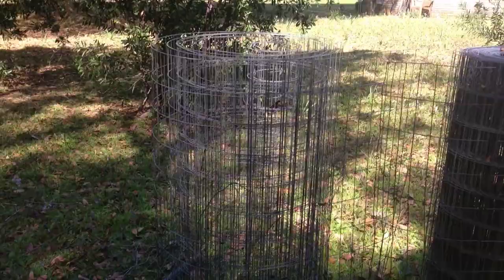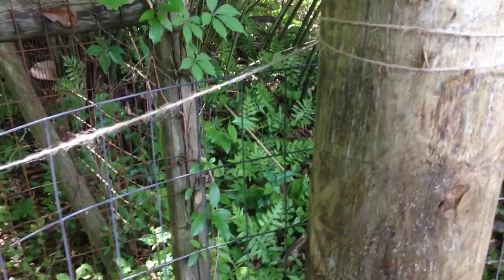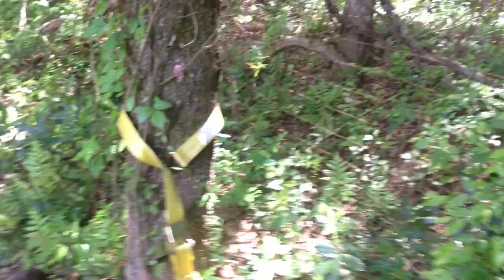I have some extra fence around but this piece wasn't big enough so I have to get into the new piece. I've got the ugly end that I'm going to cut off — it's already started to rust and I don't need a rusty fence. I've pulled my fence along the T-post and strung it up to this post. I tighten each section as I go. I would string the entire thing but it ends up not quite as tight, so I'll use a little ratchet thing on this post, nail it down, then start the next stretch.